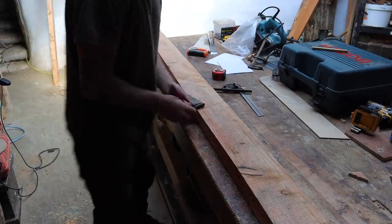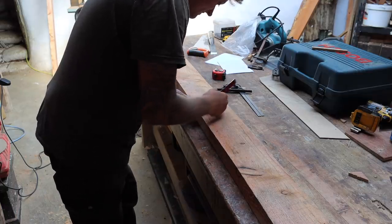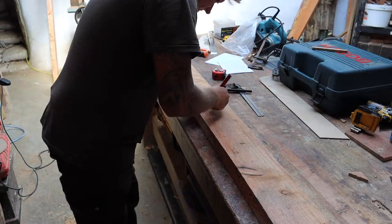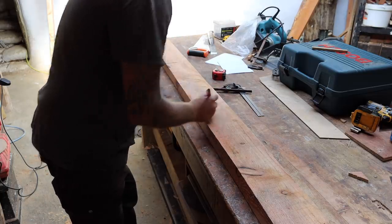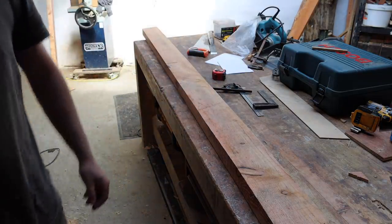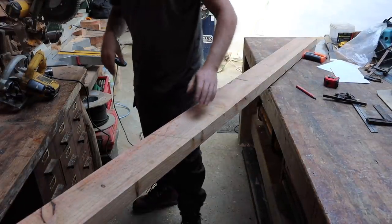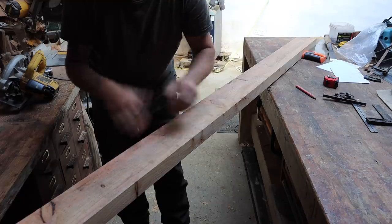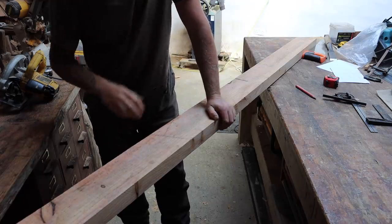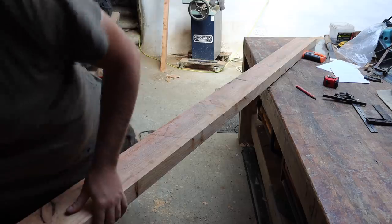Square off of that line. That's the back of the wall plate. Square off of that, 40 millimeters. I'm going to cut that out. Like I say, this isn't going to be right initially. This is going to be laid out so that the two halves touch each other. This is not going to include the ridge, but I'm going to make sure they fit right, squeezed up against each other, then cut out for the ridge.